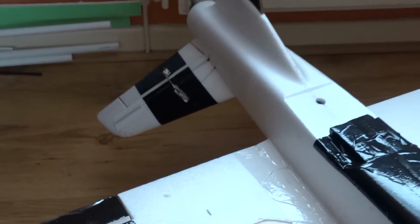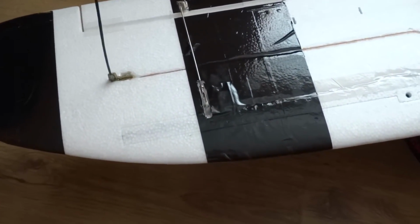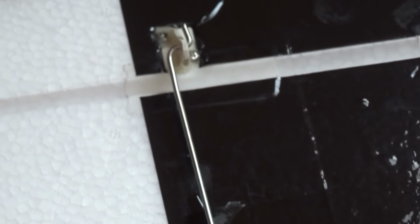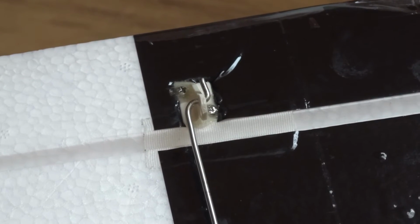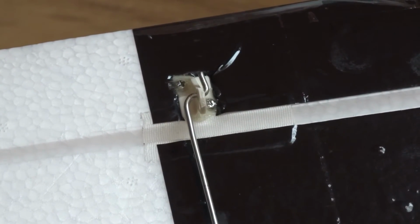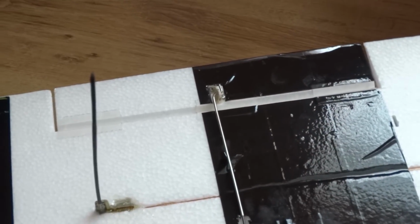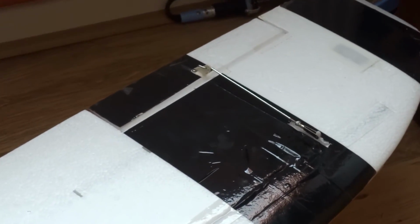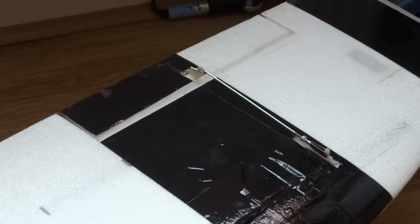All the control surfaces are 939 metal gear servos all round. They're all steel clevises and stainless steel push rods, all 4 of them. The servo horns are all bolted through the wings and connected both sides. In other words, there's a piece on the top as well, so they're bolted through top and bottom and glued. So belt and braces. All the hinges also are taped, as well as the original connection, or however it came from the factory with the foam. They've also been taped.